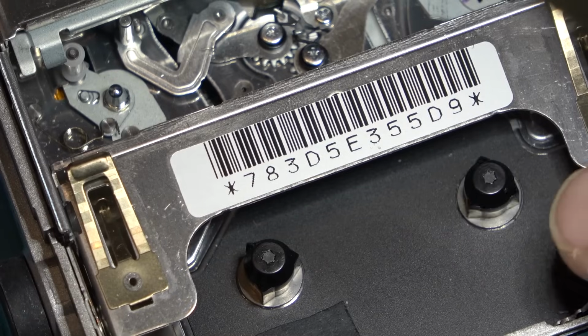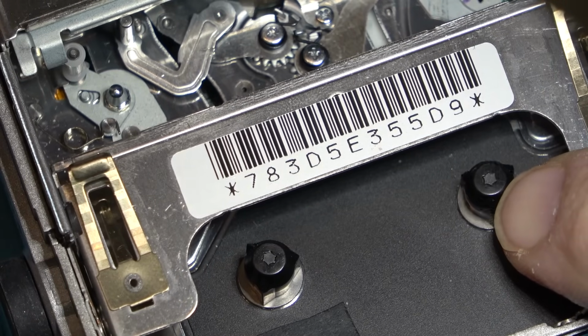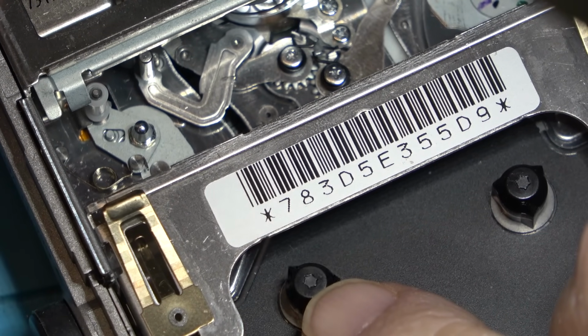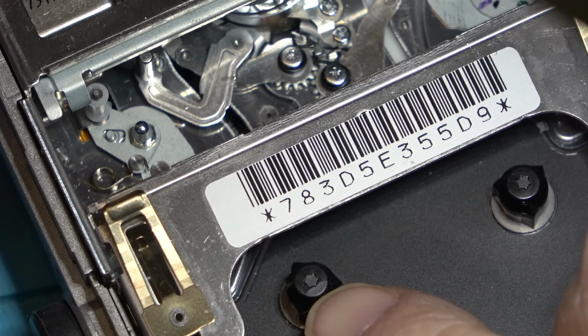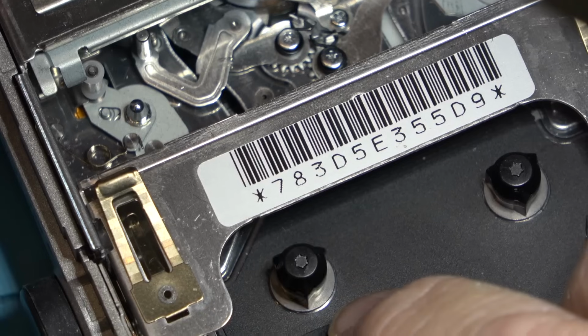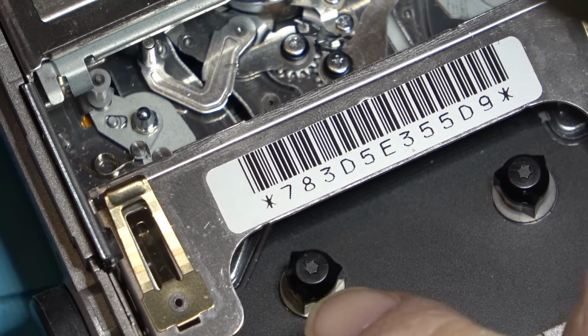I go back to reverse, and you can see that the spindle is running true, right? There's no wobble on this one. I go to the other one over this side, you'll see this one definitely has a wobble to it, and it doesn't take much to stop it. And when it stops, it actually completely stops. So I think we got a bent bearing, a bent shaft here.